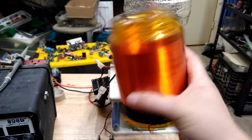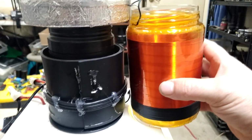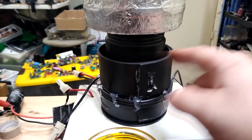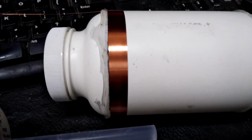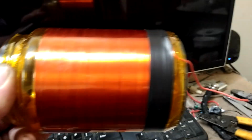I had since then temporarily used this coil, so this is 32 gauge. Jar is a little bit bigger. While that also worked, I basically just rewound the old jar with new wire. Also, this one right here is the same exact former size that's on the half bridge ramp set up over there in the middle. And so once I'm done winding that, I'll have an identical coil to that other one to test on the full bridge. So as you can see, it's a good deal smaller than this other one I had going on